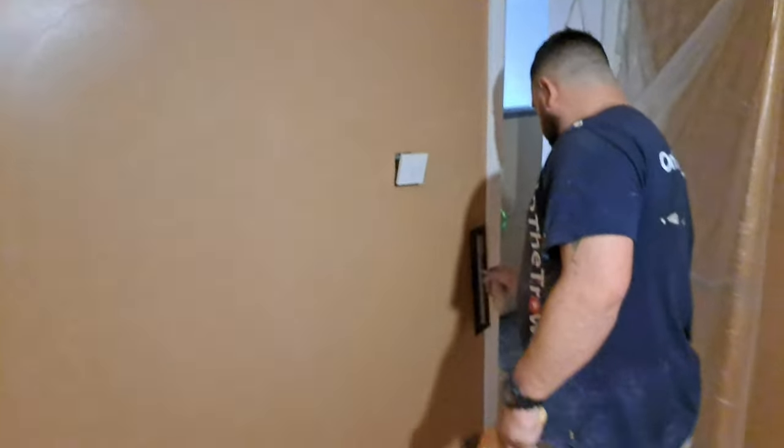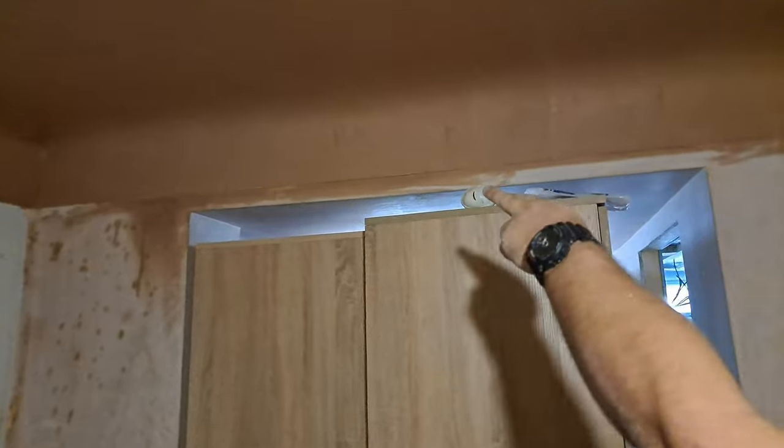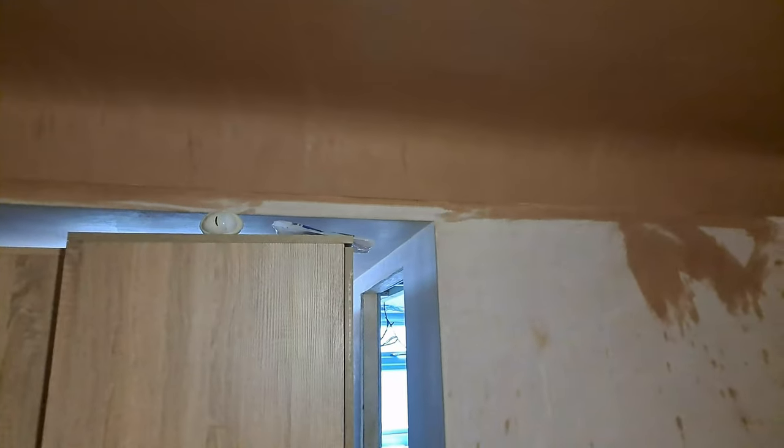With a second coat, panic station's over. That bit's going to go in a bit fast, and you can see there's a few little tears on it there, but nothing we can't handle. The key with plaster is you just don't panic. The more you panic and flatten, the worse things get. If you're worried that it's going to go off too quick, just get it flat, get all the lines out of it. I put a third coat on.